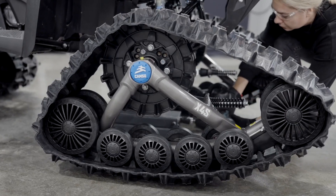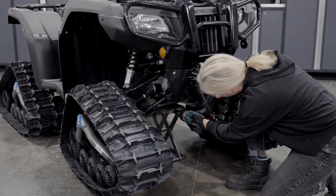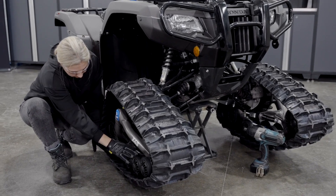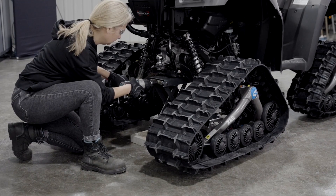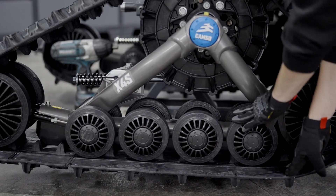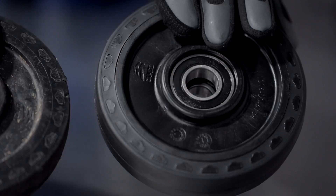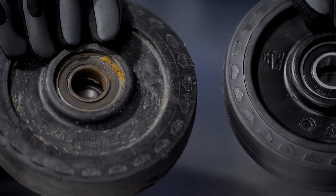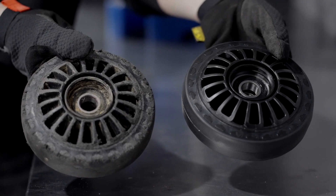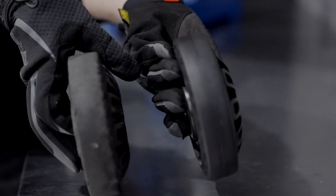The first thing you'll need to do is visually inspect the wheels — they should move freely. To see if they do, jack the vehicle and press down slightly on the lower portion of the rubber track to release the pressure on the wheels, then give each one a quick spin to see if they turn freely. A worn wheel will show signs of rust, perforation, narrower guidance strip, and/or damaged rolling bands. If the wheel shows any of these defects, you should replace it.